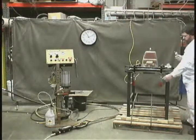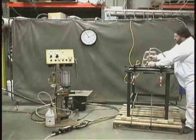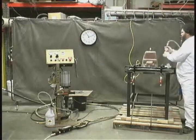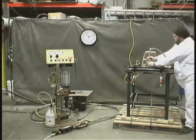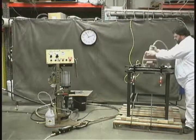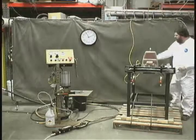Don's loosened those clamps that we put on there initially, but he's going to give it just a touch of air. Too much air obviously damages the mold. Just a quick little splat — you hear that snap — that was the release of the part. Just a little bit more to give it some. Notice that the vacuum flange clamping force is still in place, but what we're doing now is getting a release of the upper mold half from the part.